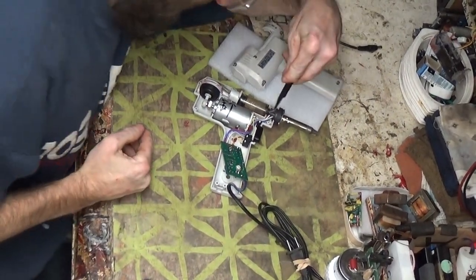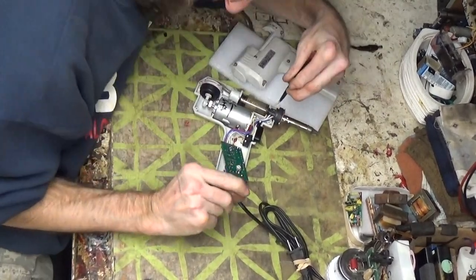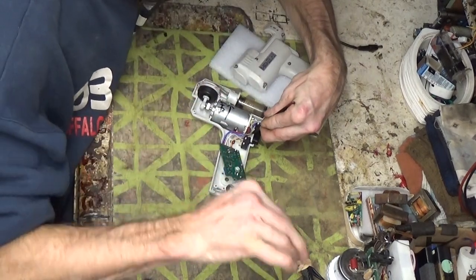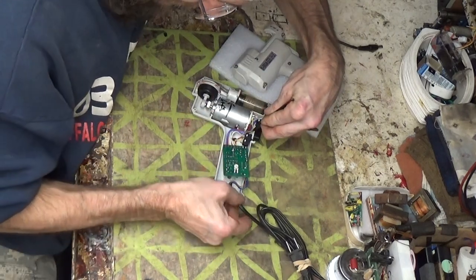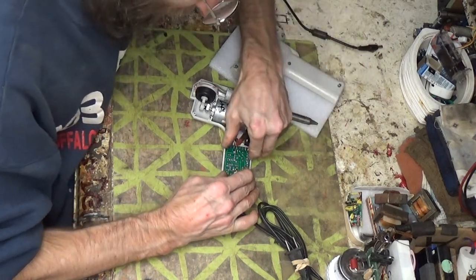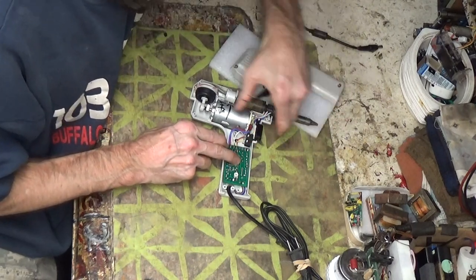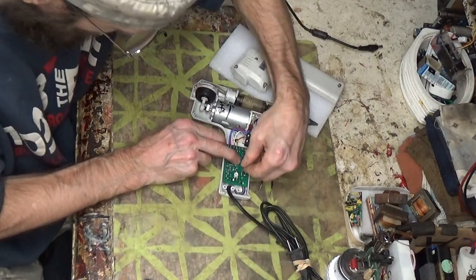And the other thing is, you make sure that you don't tuck your wires next to, because at the very back here, there is the stem sticking out of the shaft that's going to be spinning when that pump is going, and you don't want the wires pressed up against it, because as it spins, it's going to burn through the wires eventually. And it'll ruin your day. Okay. There and there, that's in, which is our contact switch. Okay, cool. Let's see if I can get these started.